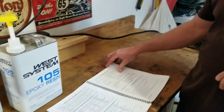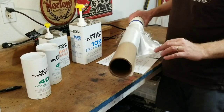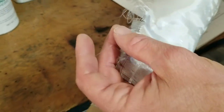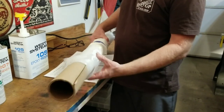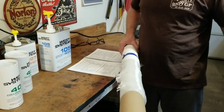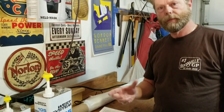The second thing is fiberglass tape. I had a hard time finding two-ounce fiberglass tape, so we ended up buying a large roll of two-ounce and I cut it into strips — that worked okay, but it's really messy stuff. This is a two-ounce fiberglass mesh; you can see it's almost see-through. When you cut it, it gets really fibery and falls apart easily. So if you can find it in a two-inch roll that's bound on the edges, it would be a whole lot easier. Something a little heavier might be better, but he recommends two-ounce because it doesn't build up a big seam on the outside. I couldn't find it in any market in America and had to buy it online from a fiberglass supplier — I'll try to put links in the description.